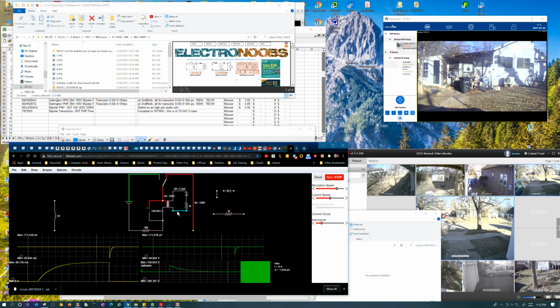It's just like a capacitor. You can take two plates and put them around a dielectric and charge that dielectric up. Then if you remove the plates of the capacitor, roll it up and store it for a while, then take it out and put two new plates on it, it'll actually still have that same charge. The charge is actually stored mostly in the dielectric. It's not in the plate, shockingly enough. This is kind of the same way.